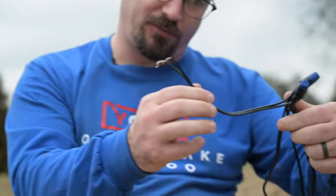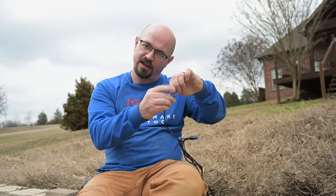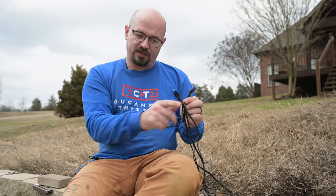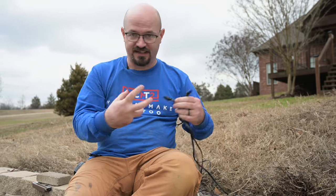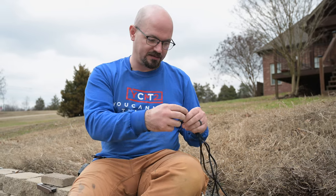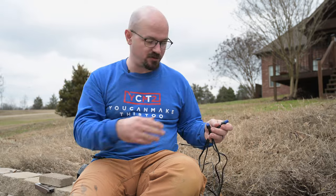So now I have four lights, but only one little jumper here that I can use my T-taps to go into the backbone. So I twisted them all together with my linesman's pliers, soldered them, as you saw, so everything's coated and definitely all in there together so everything's connected. Put on some little wire nuts and taped them up. These are extra protected too, because I'm doing this in winter when the humidity's low, so there's less trapped relative moisture in the air inside there that can cause corrosion than there would be in, say, summer.